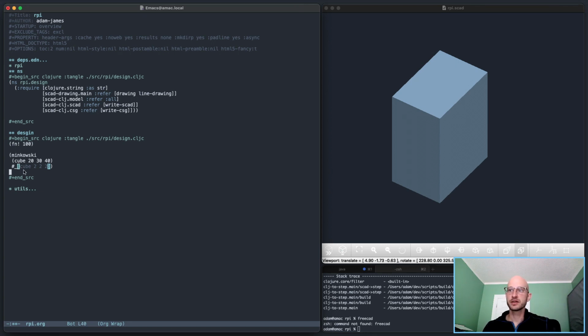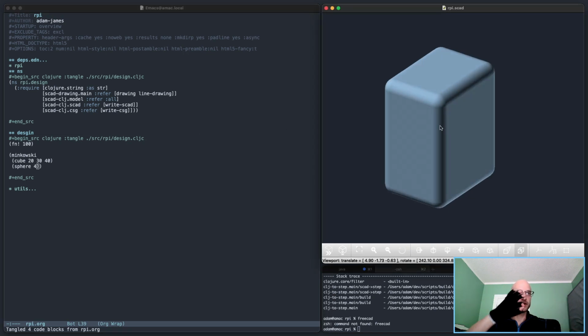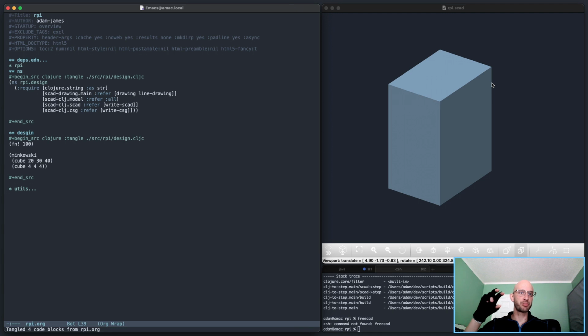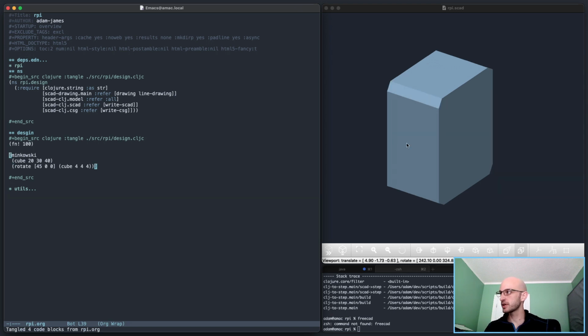Right, so here, what I was just showing, if I do a sphere again, it drags the sphere around the entirety of the shape, thus adding the sphere volume to the outer part of that whole volume. If I make this a cube, it's going to be squared edges because a cube pulled along a cube is going to be the same. If I rotate it 45 degrees on one axis, it will change how it looks. It gives it a chamfer.